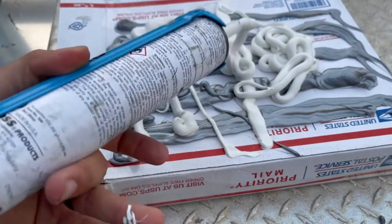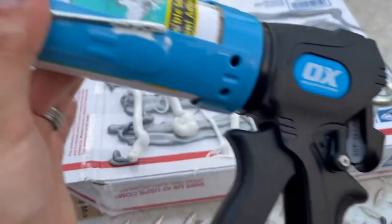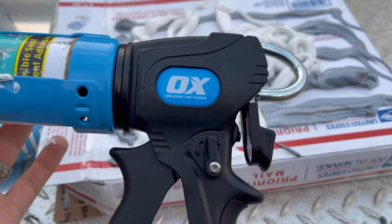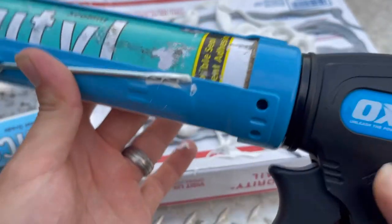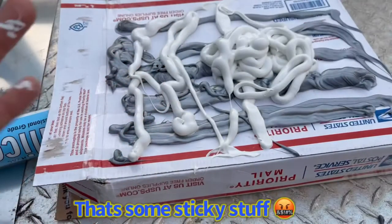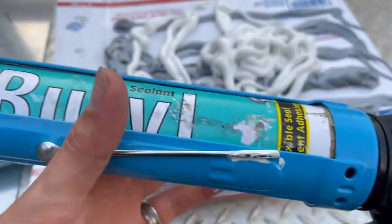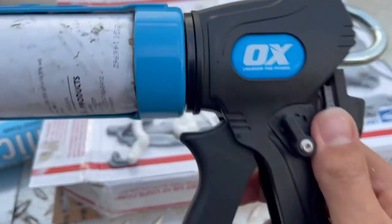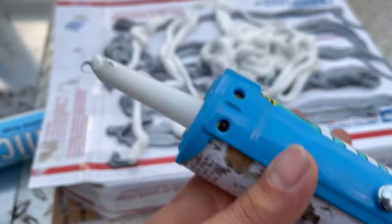It's a great option if you're looking for a versatile caulking gun that you can do multiple things with. I wouldn't want to be pumping thick material with a 12 to 1 ratio gun — I normally use an electric gun for this stuff — but on the 24 to 1 it really wasn't that bad. At 12 to 1 you're pumping and pumping and your hand gets tired and cramps up. At 24 to 1 it wasn't bad. You can use it for many different materials and it's a pretty decent gun at a decent price — pretty durable and solid. We're going to put it to the test, drop it off a couple ladders, throw it around, put it in the back of the truck and let it bounce around, and come back and let you guys know how it holds up.